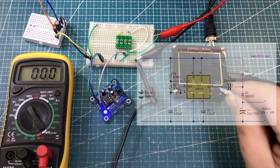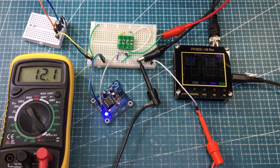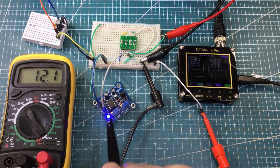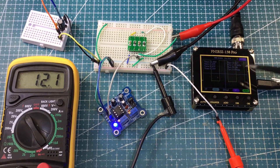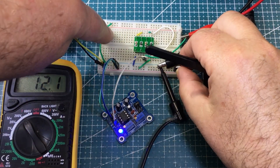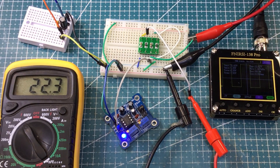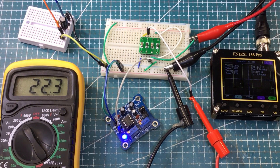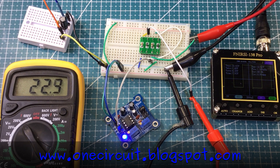So what we should be getting on this side is 12 volts — that's what's coming in. Yep, pretty good. And coming out of my 555 timer, I've got one kilohertz, 50% duty cycle. So we should be getting on the other side double the voltage, more or less. There are some losses involved with the drops across the diodes, but 22 volts coming out. Pretty steady too. Not too shabby — that is the circuit working for this week. See you next time.